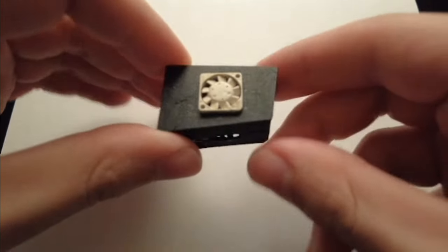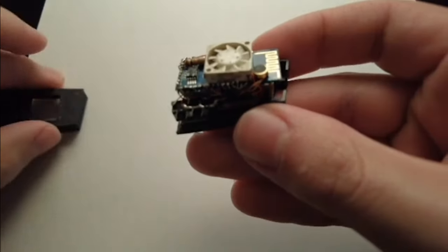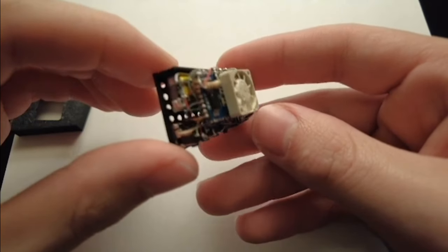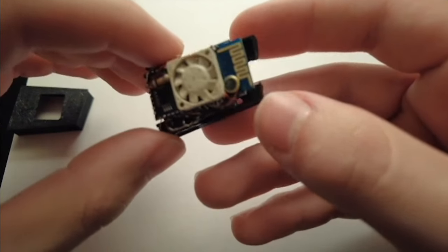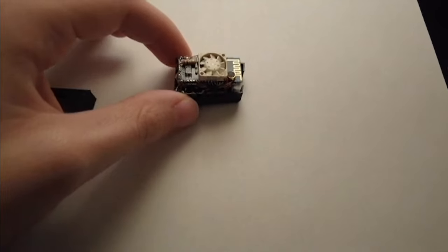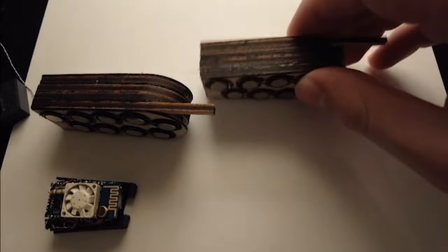This shot shows the internal computer and amplifier combo that I created to operate these absolutely ludicrous glasses. This combo is a 3-dimensional micro stack of the 100 milliamp hour battery, the charger module board, the amplifier board, the Qualcomm computer chip, 3 buttons, the dual channel 3 position switch, the 6-prong modified USB Type-C plug, and lastly, the half-inch micro fan.